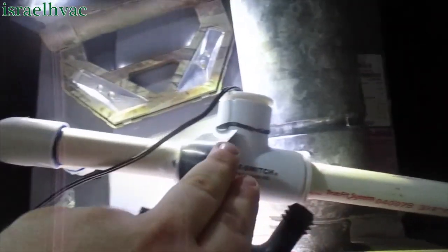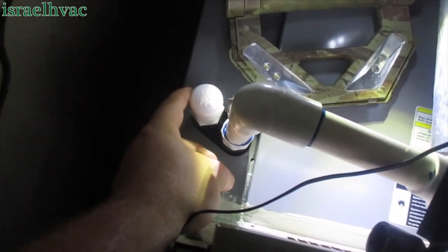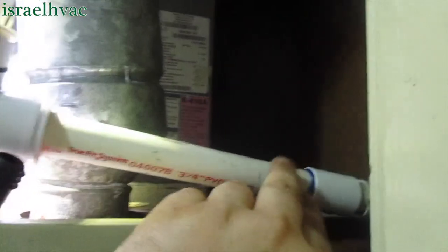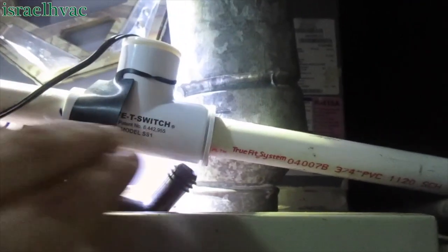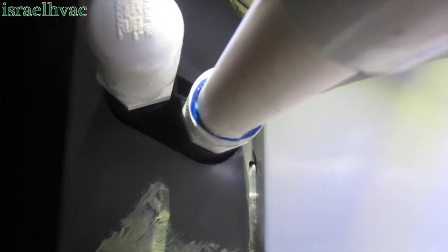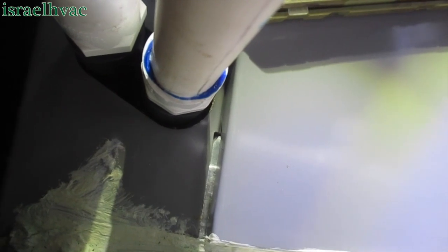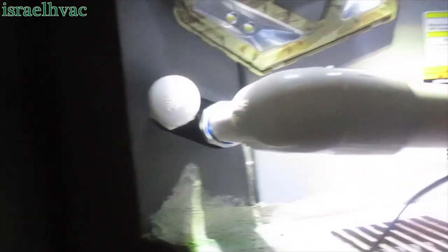Instead of the water having to back up all the way back to an SS2, now it just has to back up to the SS1 right in line and trip the switch right here. It's very rare that drains back up far up the line — they usually back up down near the drain, so it'll trip the switch right away. And see that's why I don't like that blue rain-or-shine glue — my ex-subcontractor used it and look, that fitting is not even holding. You can pull it right out.